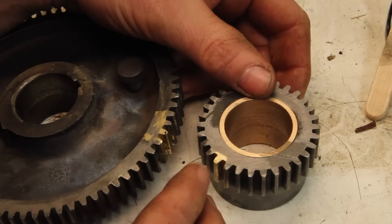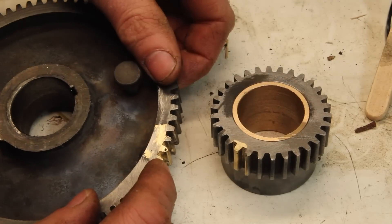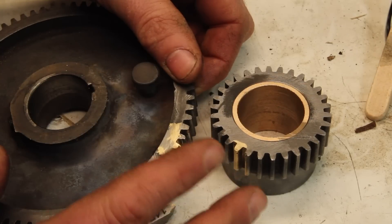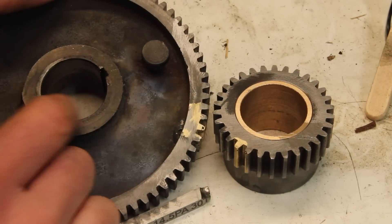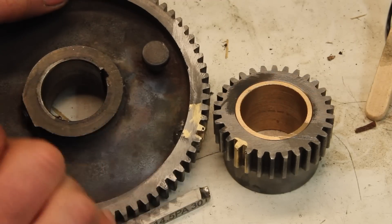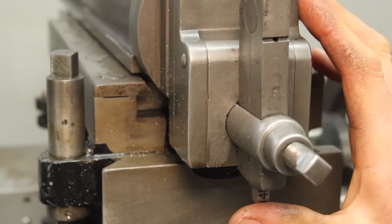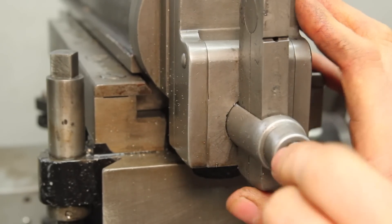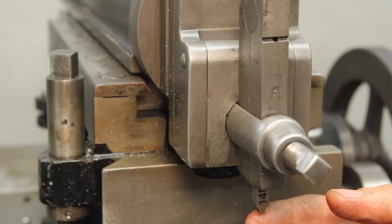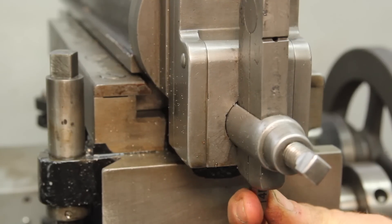The final result — the one I did first off-camera came out pretty nice, and the one I did on camera gave me a bit more trouble. After like four or five tries, what I eventually figured out was the arbor this was on was coming loose in the collet in the spindexer. Desperate times call for desperate measures, so I super glued it in. The other thing I've been fighting is there's ever so slight play in the clapper box itself, so if the tool pressure isn't perfectly even the tool kind of does some funny things once it starts cutting.